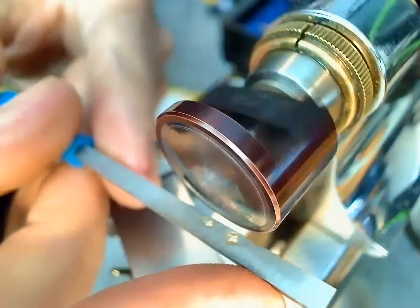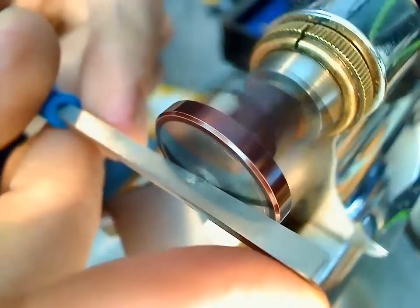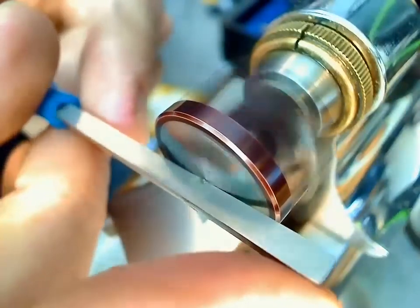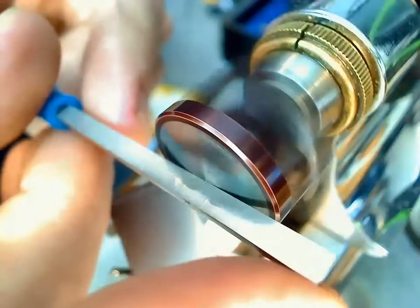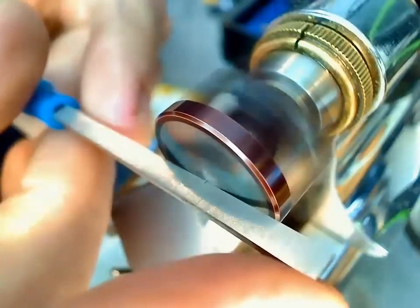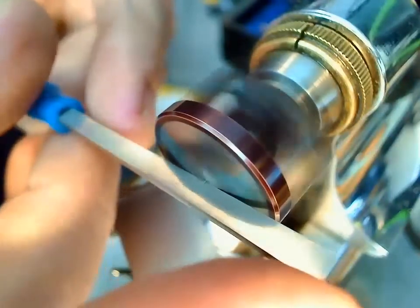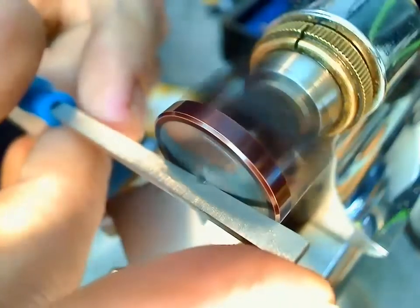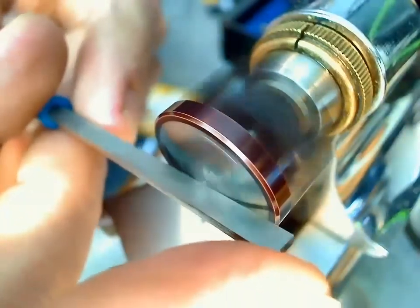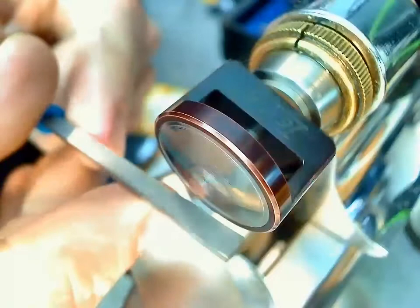and like I said, this is a practice balance staff, so I would be working from underneath like this, and I can actually feel it here a bit. And there we go. So you go back and forth here, and then you're taking some material off of the pivot. There we go. Alright, so that's all I'll do for now.